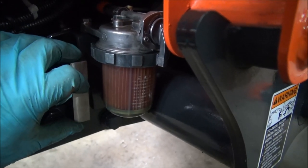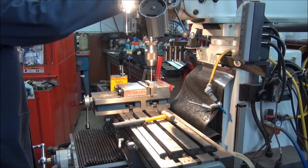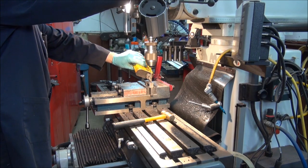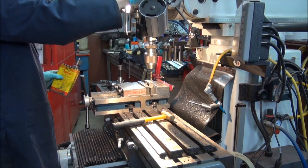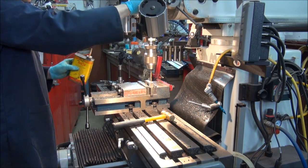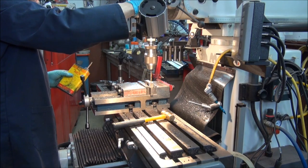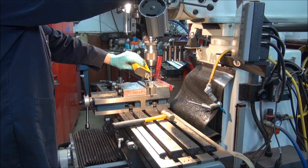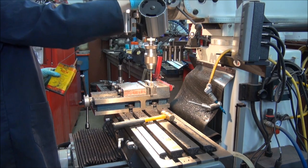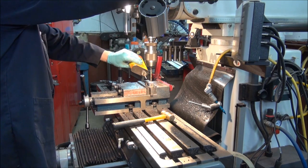It's a good job on a snowy old day. We're going to drill them out now. I always like to use a bit of cutting fluid and take short cuts — the reason being the cuttings aren't too long and they're easier to clean up. The cutting fluid is essential because the cleaner the hole is, the better the thread will be when you've got to thread it.